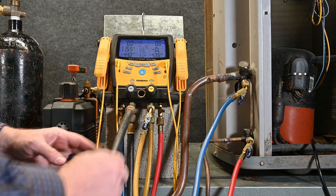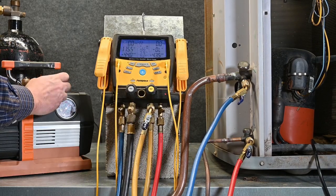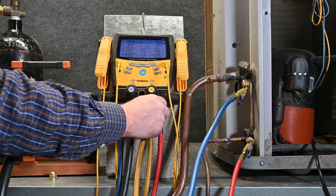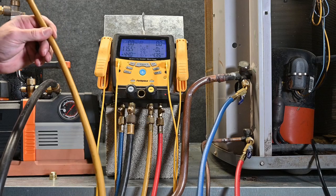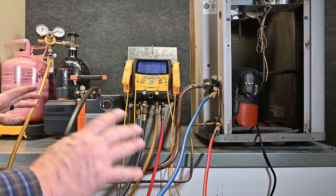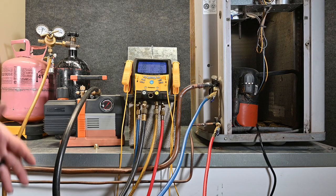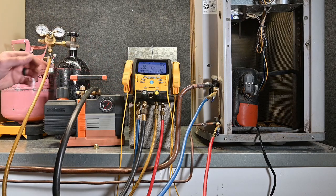We have this very large hose. We're going to take it loose and install it on our vacuum pump. We also have this extra fourth hose — it says REF or refrigerant on it. For right now, we're going to install this on our nitrogen tank. Everything is set up with the system valves closed and the unit valves open. What we're going to do first is purge the system just like before, except because we have this four-port manifold it's going to be a few different steps.